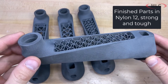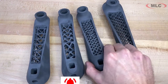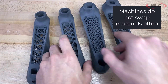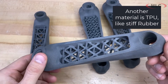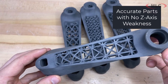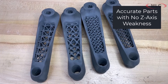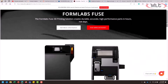For these parts, you typically won't change materials. This nylon 12 part will take a really long time to clean out the machine from all that powder to switch to a different material. But nylon 12 is so versatile and extremely strong — it does a really nice job for your high-end parts. The only other main option you would look at is a TPU, which is like a rubber. For anything touching the skin, anything that needs a little bit of flexibility or impact resistance, the TPU is another option. But you would really not typically switch back and forth — you may have multiple machines on nylon. These don't have any Z-axis stiffness issues and are extremely strong, suitable for selling to the end user and putting into production.